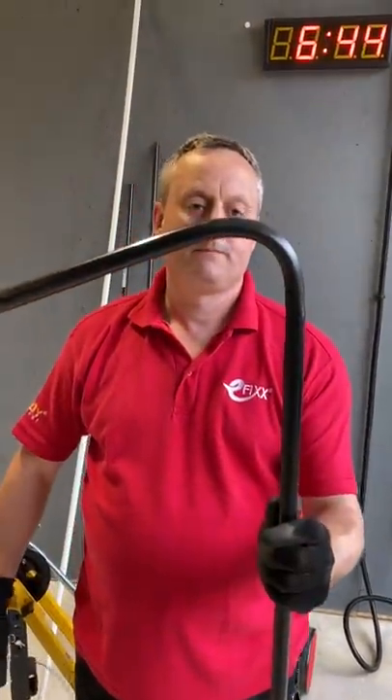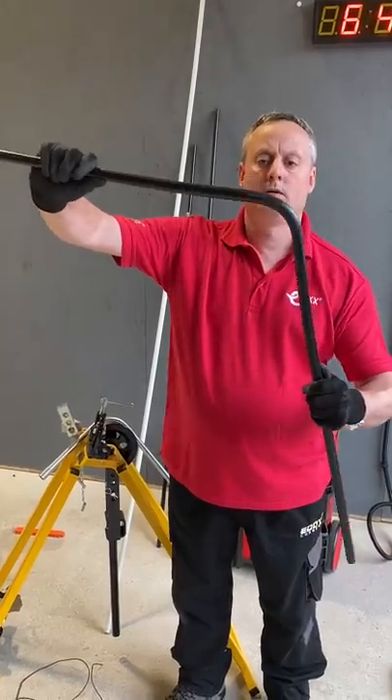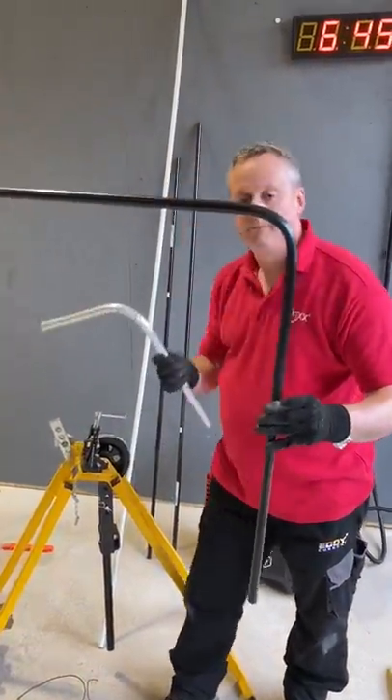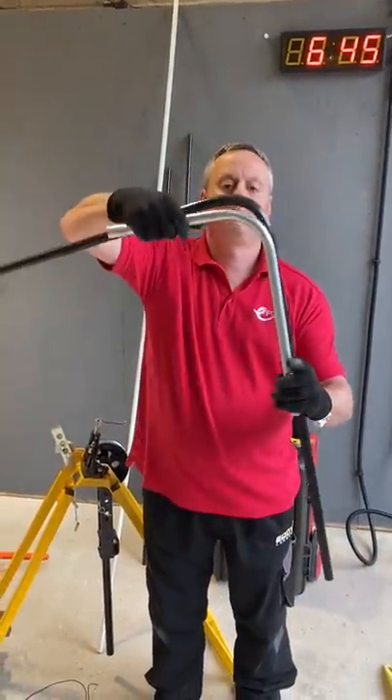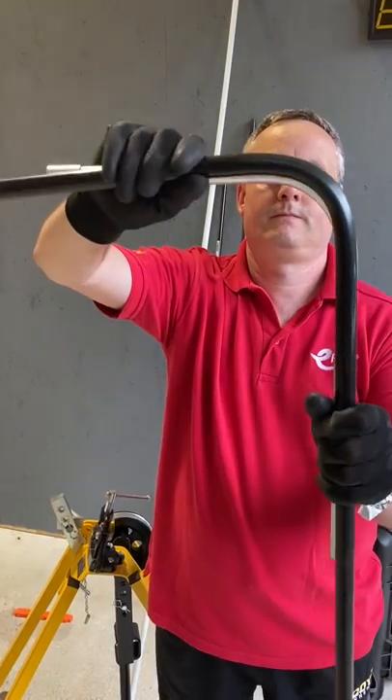Pull out my spring. I'm now going to rest the conduit — I'm going to leave it some time and you can see it's still over bent. So I'm going to pull it out to 90 degrees. The only way to check is to take a piece of steel conduit that was bent in a conduit bending machine behind me, and you can see a perfect 90 degrees.